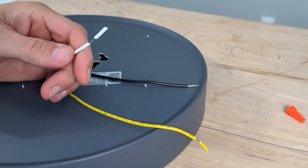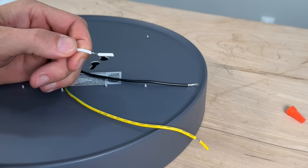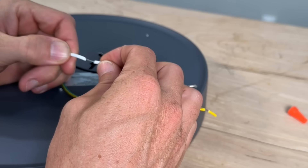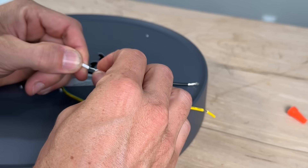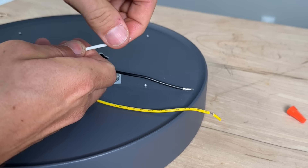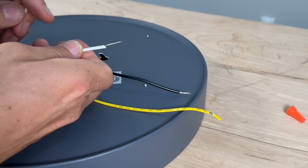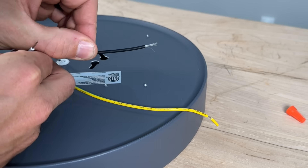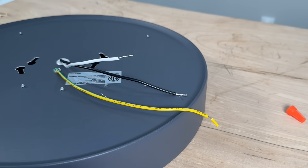Using the correct hole makes sure you're not damaging any of the strands. Another tip: before you take off the insulation, use the insulation that's still on the wire and twist it to bring all those strands together. When you then remove the insulation you'll have a nice clean twisted piece of stranded wire, opposed to strands fraying out.